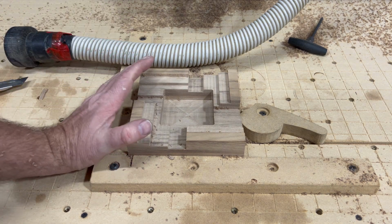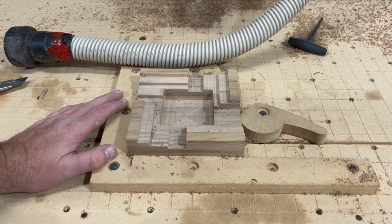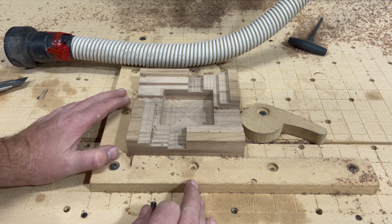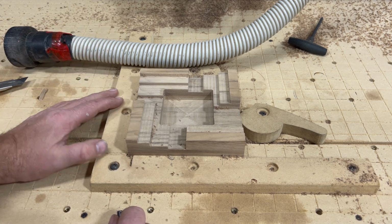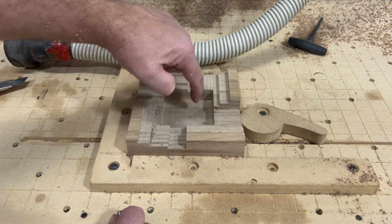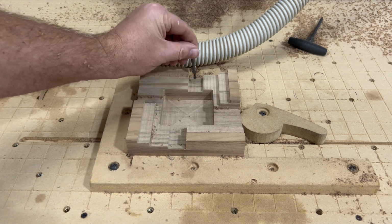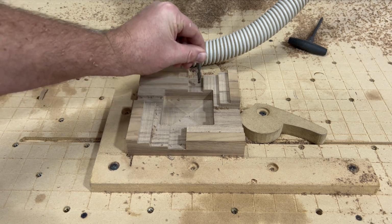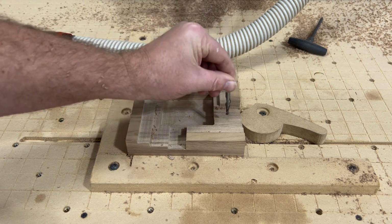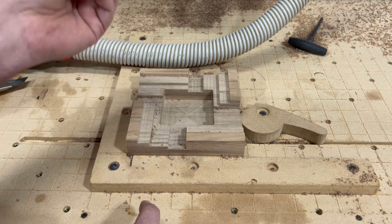And I can't seem to figure out a way to get that to stop. Basically, the problem with it is it's adding more time to your carve, not a ton of more time, maybe a few minutes. But if there's anybody out there that's an expert in Vectric VCarve Pro in dealing with tool paths that would allow us to eliminate that carving air, that would be great. Because the same thing is going to happen with the ball nose. You're going to see the ball nose coming into this open pocket and carving air, and that's just going to take more time. That's where you're going to lose the time on this thing. It might be an extra 2, 3, 5 minutes. I don't know.